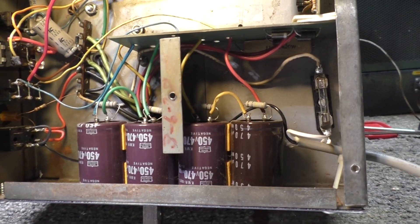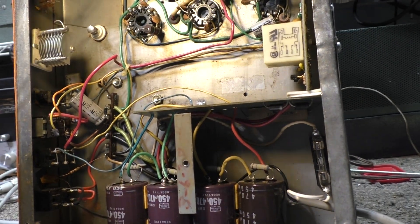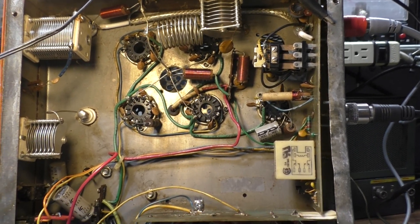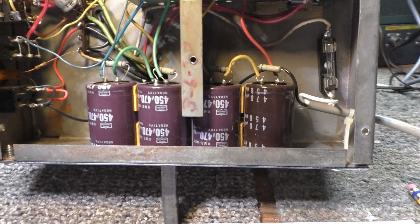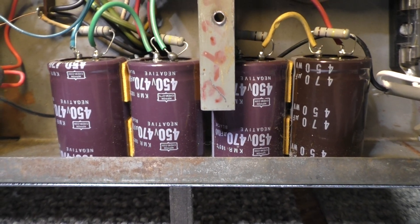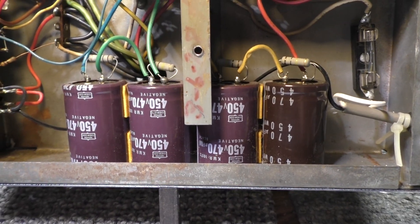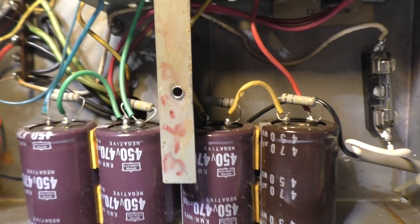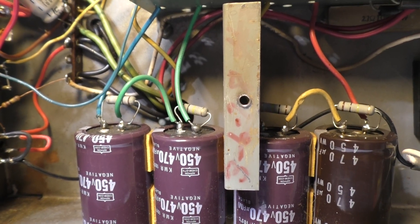I got it with no tubes, but I have tubes — I've got a pretty good stash. I bought it at Dayton and did my little happy dance, got it for a song. I'm trying to get some of these projects out of the way; I'm very, very behind. So opening this one up to get it started and see what it needs. My initial thoughts were, hey, somebody already rebuilt it — they recapped it. They put in new-style modern can caps and used 470 UF, which is way overkill for this amp. Most versions of this amp don't have bleeder/equalizer resistors, but somebody put some pretty heavy 100K bleeders across each cap. And that's good.